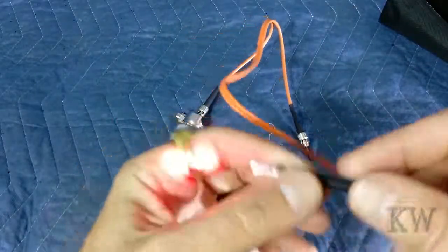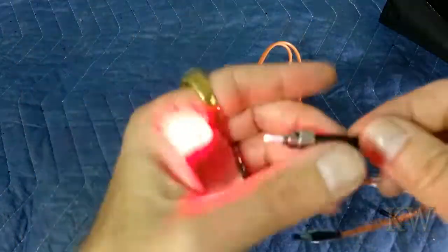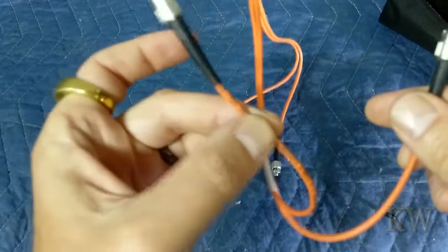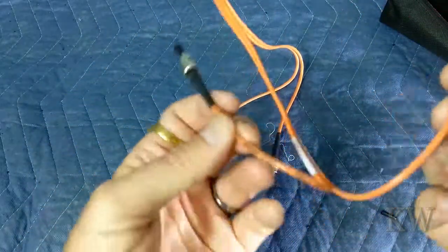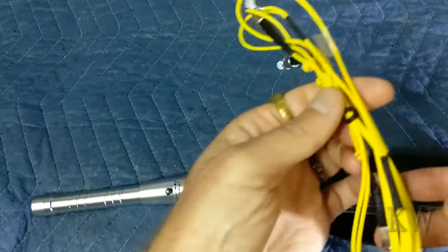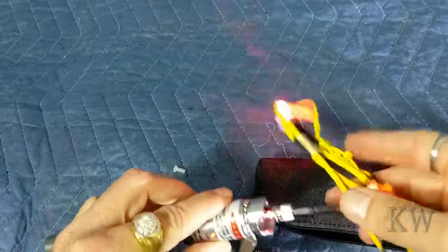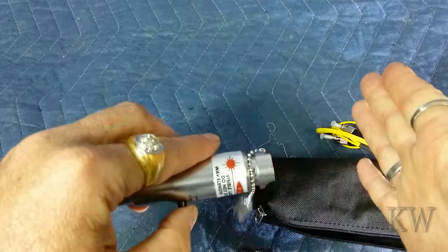You can kind of hold it like this and see this one is very bright — it's a really bright fiber tester. If you plug two of them in and one end is really bright and the other is dim, you know somewhere along the way that strand is bad, kinked, or most likely dirty. It also works on single mode jumpers — you plug it in the same way, it's just a light. You can see it glowing at that end, so we know that one's probably good.